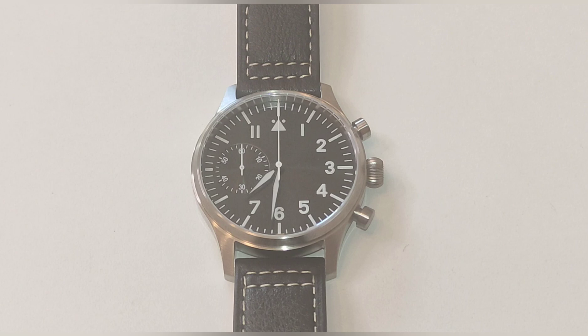The battery lasts 3 years and gives approximately 20 seconds per month deviation. It is recommended to run these calibers through a full rotation every two weeks — you should make them work occasionally for proper maintenance and to avoid failures. We have a flat sapphire crystal. The hands are lance-type. The screw-down caseback features a delicate airplane silkscreen. The watch price on Aliexpress is 83.96 euros. I will leave the link in the description and in the pinned comment.